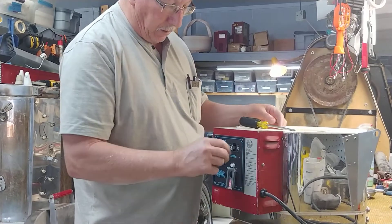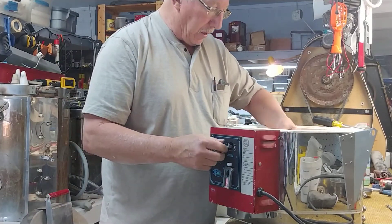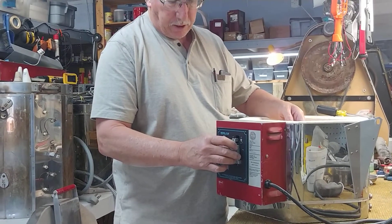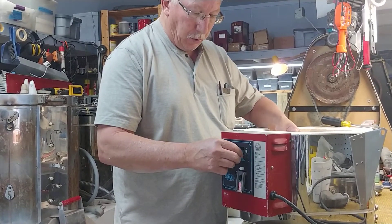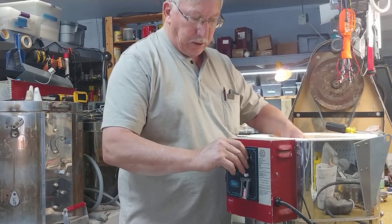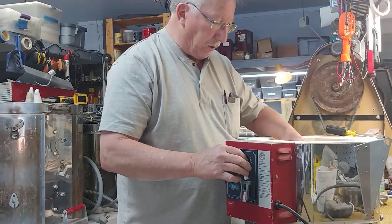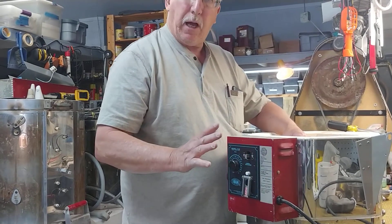If you take this off you can actually turn it, and if you have your guide key or alignment key, you place that on your cone supports with the sensing rod going through the center of the key — this is how you align your trigger release. If this is in alignment, the release should just miss the claw. To check the rod for bends, put the key in, hold it, and rotate it. Look at the rod — if you see a wobble or a warp, these rods have a tendency to get a banana bend in them, and when you go to do the adjustment you're compensating for that bend, which can change the calibration of your cone firing. If you turn it and don't see a wobble, the rod is perfectly fine.